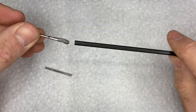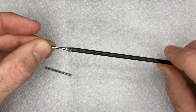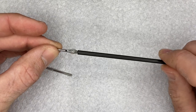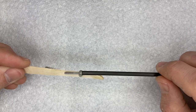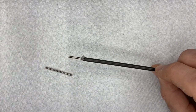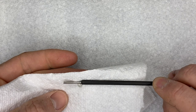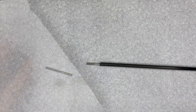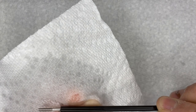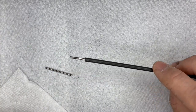We're going to take this and insert it into our carbon rod. I like to kind of push in and pull out to try to get that epoxy down inside the carbon tube - get as much epoxy down in there as possible. Then take the popsicle stick and wipe off any excess. Come back with a paper towel and clean it as best as you can. You can come back with a second paper towel with alcohol - alcohol will cut and clean the epoxy for a nice clean joint. Remember the alcohol is going to take our mark off. Now this side is done.